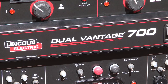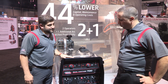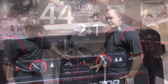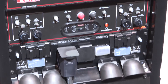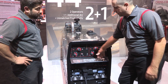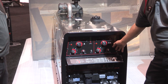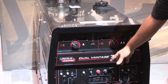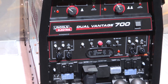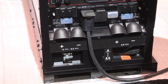Tell us a little bit about the Dual Vantage 700 — there are a lot of things you can do with this. The Dual Vantage 700 is a single or dual operator machine, so you can have one or two welders welding simultaneously off of one machine. Max output is 800 amps at 43 volts at 100% duty cycle. When you're in dual mode, you can use different processes for each arc — stick, wire weld, or arc gouge off the left side up to 400 amps, and the same on the right side up to 400 amps. This machine also provides 20KW of three-phase and 12KW of single-phase auxiliary output, giving you the option of running a V275 off the auxiliary circuit and running three arcs at one time off of this engine drive.